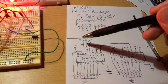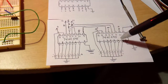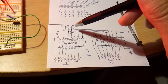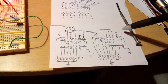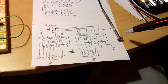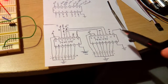The data pin goes straight in, but also from the second cascading shift register, pin 9 — which is serial out — is connected to pin 14, the data pin of the second preceding shift register. Then pin 12 connects to pin 12, and pin 11 connects to pin 11 clock pin. Connect pin 13 to negative, pin 10 to positive, pin 8 to ground, pin 16 to positive. Pin 9 you don't connect unless you want another shift register — if you want 24-bit, connect another shift register there, and pin 9 goes to pin 14 of that one, with pins 12 and 11 all connecting together. You can have as many as you like.